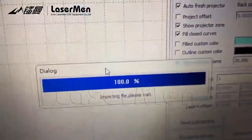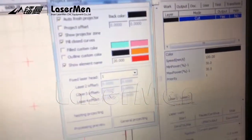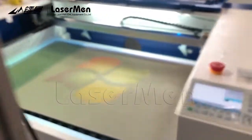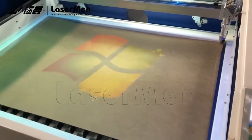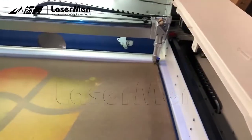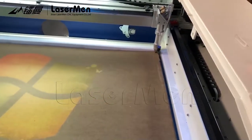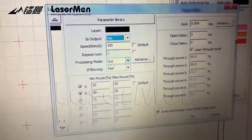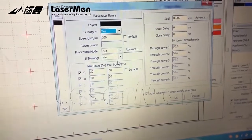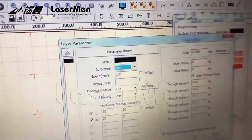Step 2: Block cut. Click 'Block Cut'. Here we have some block and cross cut options. Put an empty sheet here — wood sheet or MDF sheet is okay. The left head focus length should be adjusted well; make sure the focus is already adjusted. Then put the left head in the home position. You can set the output power and speed. Put low power output and very high speed so it will not cut through — only mark the crossings.